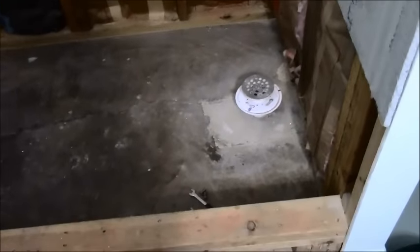And then my bushing, I get that in there. The bushing is already attached by virtue of a smaller piece of inch and a half that I've already pre-put in there. There's not any glue on it right now, but you need enough bite on both ends. So the bushing is where my thumb is at. The little piece of inch and a half is right there, and then you have this part of the 90, and then the drain fits right on top.